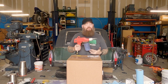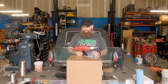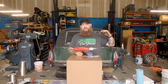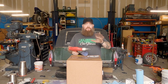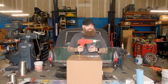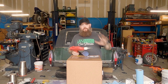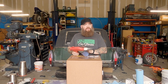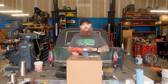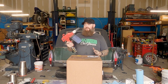So we started off with this — a Redline EZ50. The Redline EZ50 is a fine entry-level gun, kind of the super lower end of a pro gun. It's a step up from the Harbor Freight gun, and above that is the Eastwood dual voltage, and then this. These are all very good guns — you can do most everything with them. The problem we were running into is the fan powder is not great when you're doing multiple coats. We were powder coating things with multiple coats — two or three — but if you really had to lay on a good powder coat, a primer coat, then a color coat for a base with a mask, then another coat on top, peel away the mask, and spray it with a clear, you're now up to four coats, and this thing just didn't have the guts to do it.